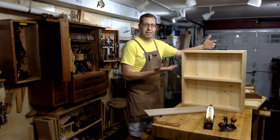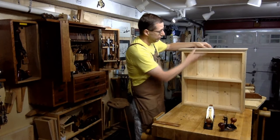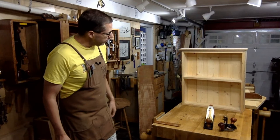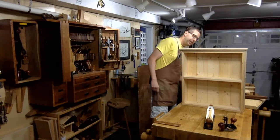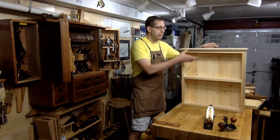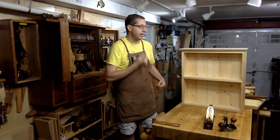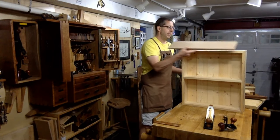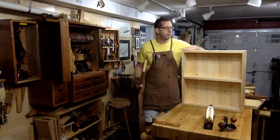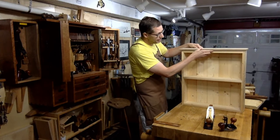Well, in this instance, we're already in an assembled case. There's not a whole lot I'm going to do here. This is just going to get glued onto the top because all the wood movement is in concert. So I would come in and determine, is that good enough? The gaps I'm seeing in the back are caused by the overlapping shiplap boards, but I would want to hold the piece in situ, again, try to close any gaps that I'm seeing, and determine whether it's flat enough from there. And if I have determined no, it's not flat enough, then I can begin to analyze where the high spots are, what I have to remove. In this case, I need to remove this little bit of shiplap board here, a little bit there, and a little bit right there to allow it to sit flat in the back. Or maybe I don't, because it's going to be a wall-mounted cabinet. This backside is never going to be seen.